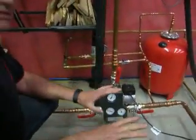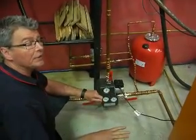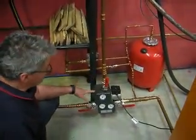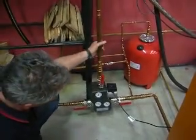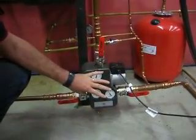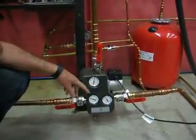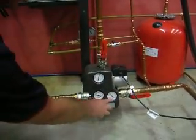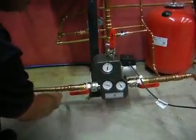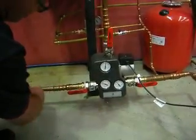There are lots of advantages to this. One is it helps conserve the long life of the boiler and avoid condensation issues. The next thing is that one of the other features of this LATOMAT valve is that it's more than just a circulator and a valve — it's got a thermostat in it. This one is set to 63 to 65 degrees centigrade. When it gets to that temperature, it will permit cold water to come in from our accumulating tank and be mixed with this hot water coming in and then go back into the return line.